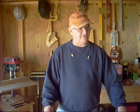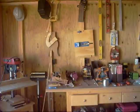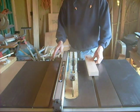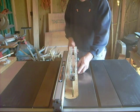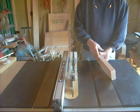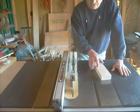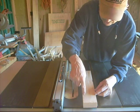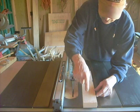When I push a board through, it shouldn't catch or drop down. I'm out about a quarter inch, so I'm not too far off. Over the winter the supports may have frosted and sunk, or one side rose — either way it's not level. I'll set my fence two inches off the blade, rip the piece to give me an inch-and-a-half thickness and two-inch width, leaving room for four screws with the bolt centered.